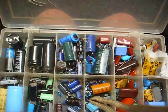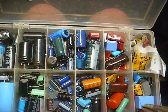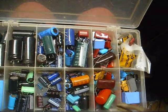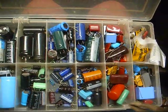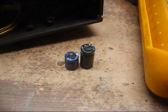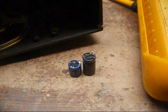And here's my used capacitor stash, and I'll go ahead and look for two while I'm in here, because I believe the other value is the same voltage. This is a 500 microfarad, 12 volts. We'll look for a 470 at, say, 16 or 25, something along those lines will work. Okay, here's two 470s. They both check within tolerance, so we'll just stick them in there.